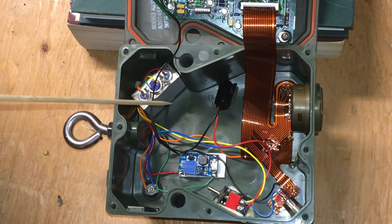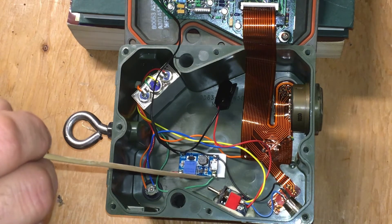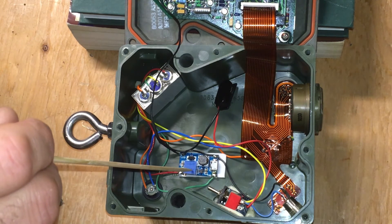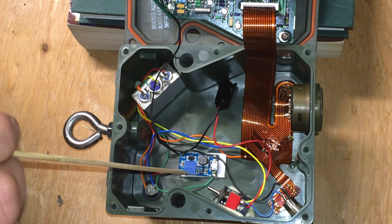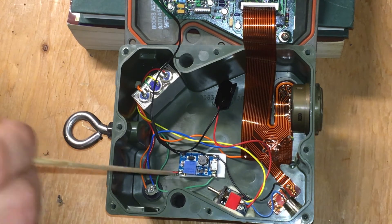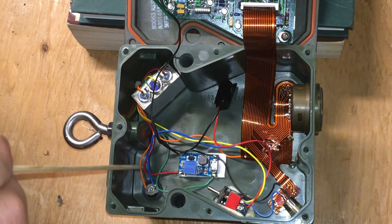When the original switch is turned on, voltage crosses over and goes down the green wire, following it to the input of the MT3608 boost converter. It does its thing inside the boost converter and boosts the voltage up from 12 volts up to 26.7 volts, then comes out the positive output to the red wire I cut off of J1 — which was pin C.